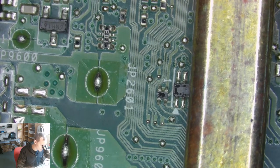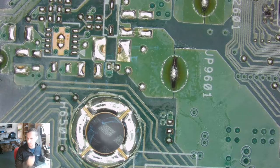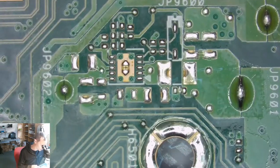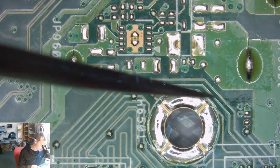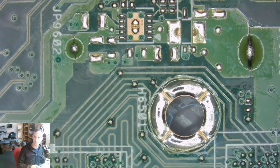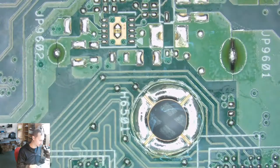Nice. So, the CPU gets hot, then we have a line which I don't know where it belongs, but it's probably a 19 volt rail. Where's my tweezers? This line here, this fat line, is getting very hot. You could see that under the Fluke cam. Without the cam, you just see a hot CPU and a running cooling assembly.